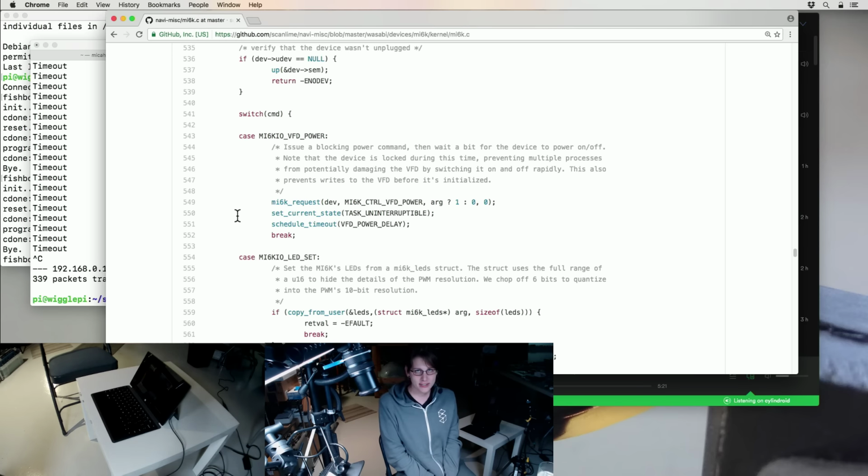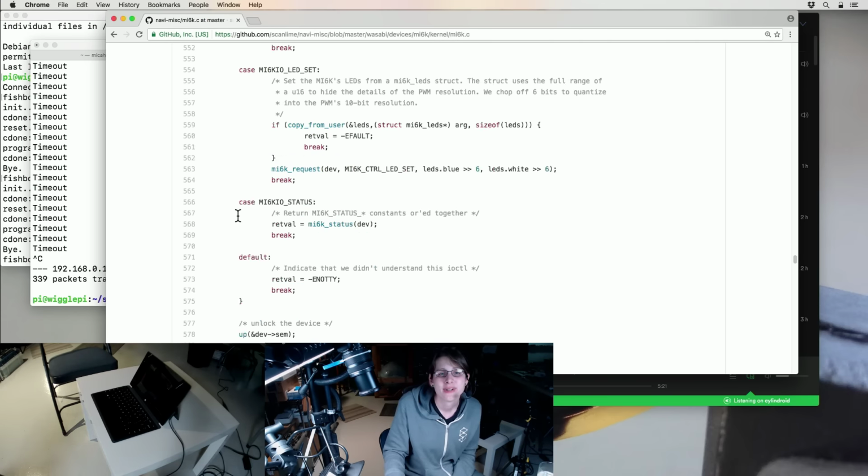So that's actually one thing I haven't decided if I want to keep. As I mentioned, there's a transistor that lets it turn on and off the VFD. I don't know if I care about that. I mean, it will probably save tube lifetime if I can do that, but there might be other ways to do that. One option is to use a USB to serial converter, but have a really little microcontroller just do power management, and it'll just turn off the power if it doesn't see serial data for some amount of time, which seems pretty sensible. Which is probably what I would have done in the first place if I hadn't already had a reason to make this thing so custom.